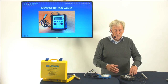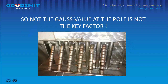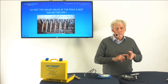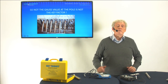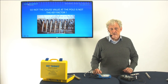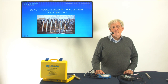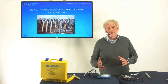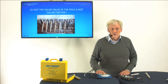For the time being you have to work with Gauss meters to verify it. You shouldn't only focus on the high Gauss value — you also have to focus on the closed pole. No open pole anymore. And you should define what you want to catch: iron, or stainless steel 304. Stainless steel 316 is just very, very difficult and you always need extra systems to trap those particles. There are many more videos about how to measure magnets, force index, different systems, block systems, and bar systems on Goudsmit's YouTube channel. If you have questions, don't hesitate to contact us or visit our website. Thank you very much.